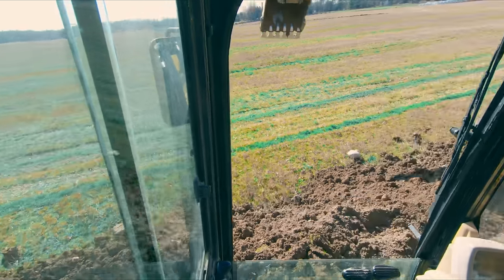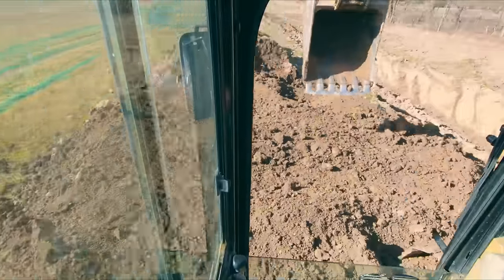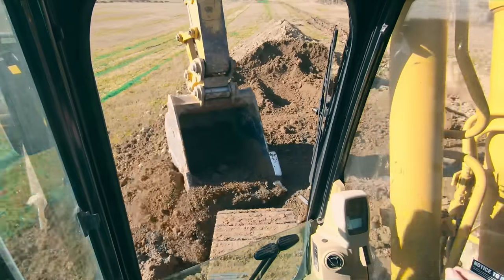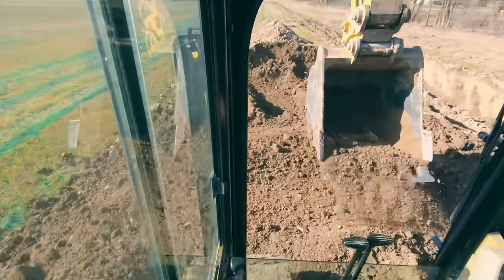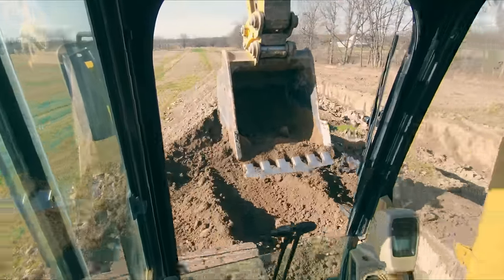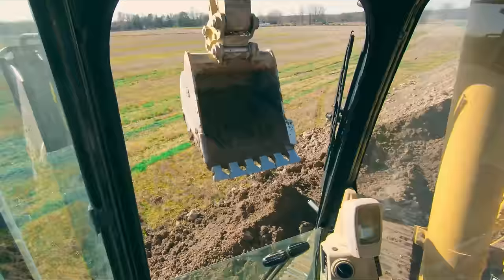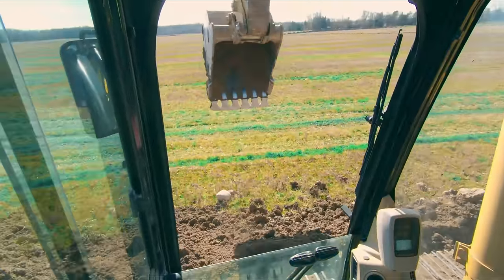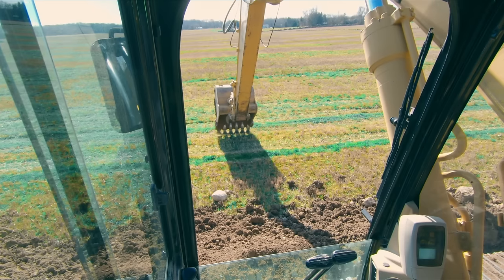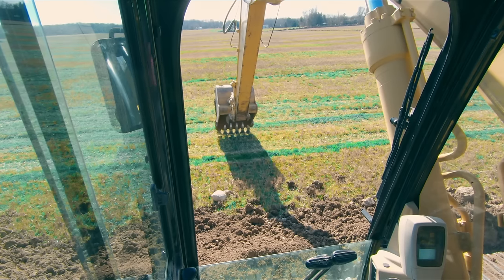Versus if I take my 2 minutes here to level my pad off, and then we'll track up on it. Now you can see when we go out there, now I can dig a nice flat hole. I save my labor a ton of handwork. We're all good. So take the extra time. It's not a waste of time if it's gonna help you dig more efficiently overall.